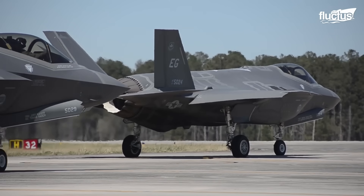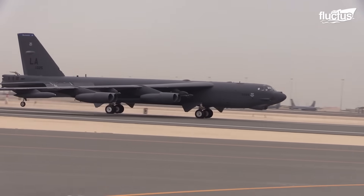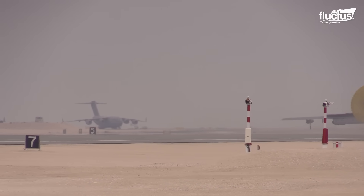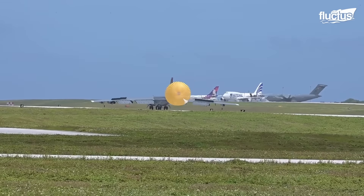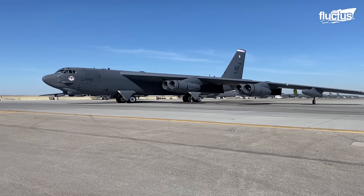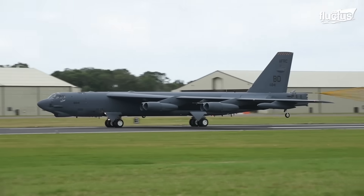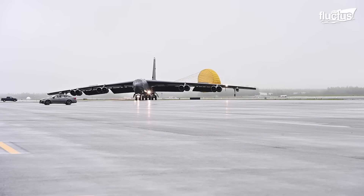Akin to the F-35A parachute, the B-52 Stratofortress uses a parachute for the same reason. Unlike fighters, a bomber like the B-52 is extremely heavy, and stopping one upon landing is exacting — this becomes more challenging if the runway is slippery. To cater to such scenarios, the B-52 is equipped with a drogue parachute to decelerate the aircraft upon landing. The parachute is stored in a caudal compartment and releases at 170 knots. Initially, the white-colored pilot chute deploys, pulling the colossal 44-foot diameter drogue parachute out. The ribbon parachute used in the B-52 can be used for more than 50 landings.